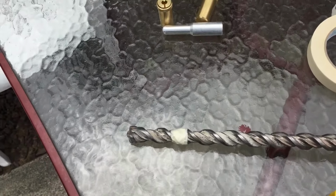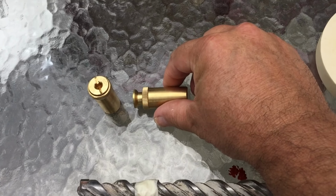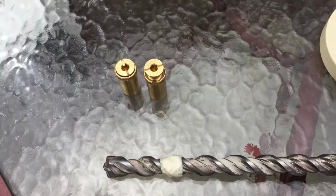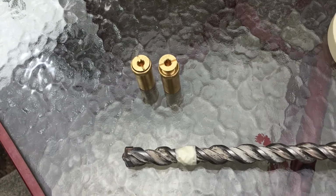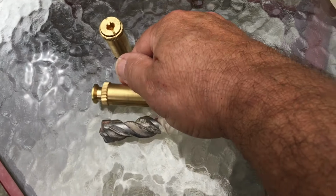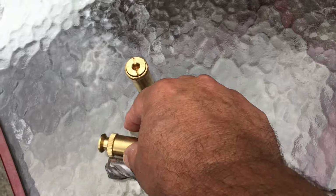So these are the anchors that get put in the cement, and you don't find the instructions on how to put these in the written instructions. You have to see a video. The video says that we have to drill a hole 2 1/4 inches deep, which is, whoops, more than deep enough. So it must be for dust and stuff, but we're going to vacuum the holes out.